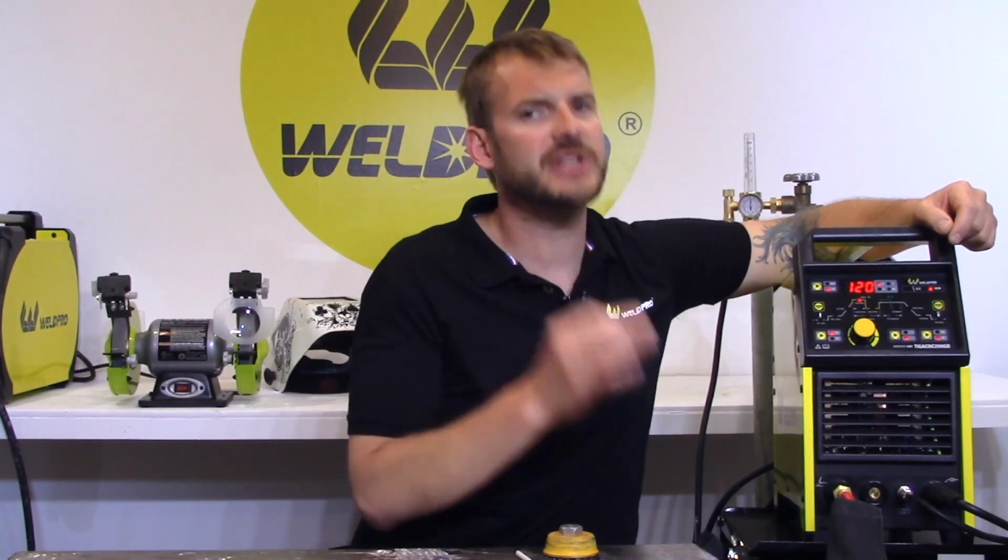We're going to talk a little more about upslope and downslope when we start talking about the trigger switch, so watch out for that video. For standard welding processes, make sure that your upslope and your downslope are set to 0. This is very important.